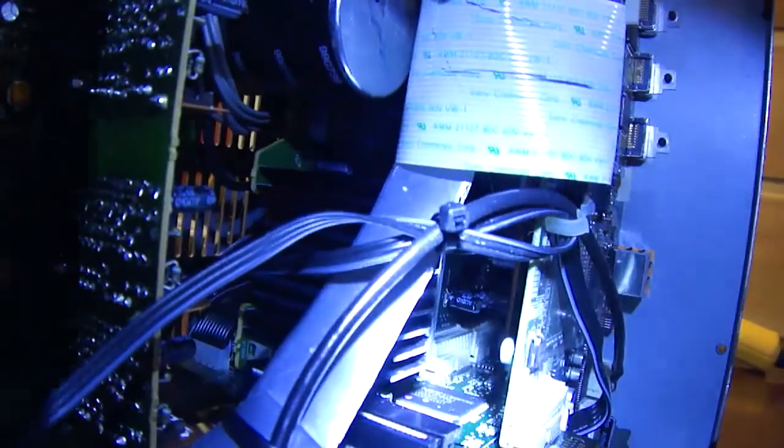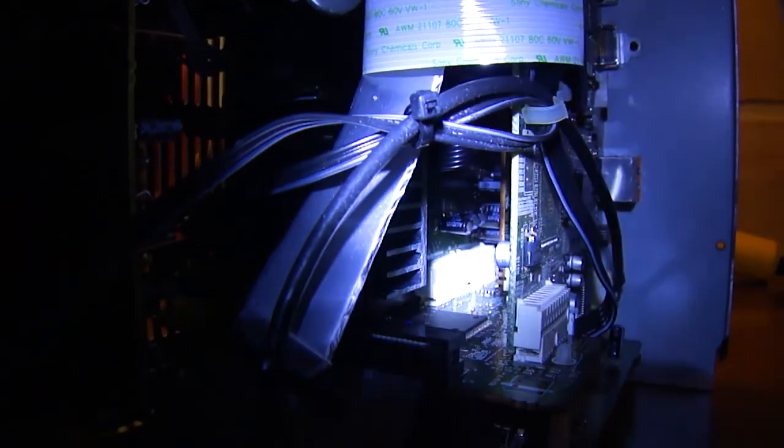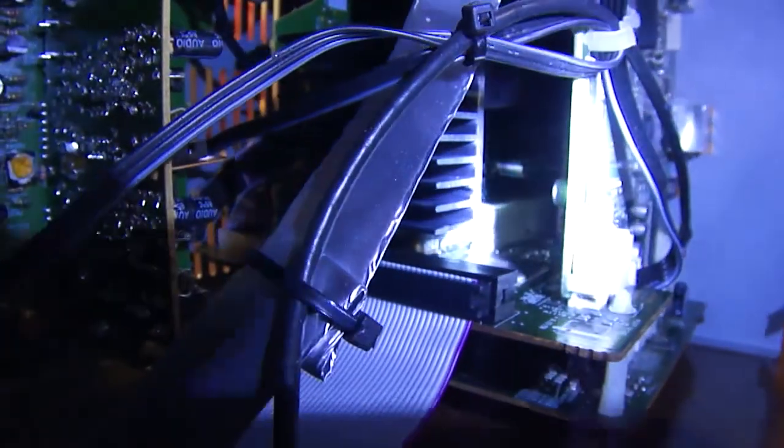Directly above that, I don't think I can get it in view here, there's an aluminum capacitor, and there's probably some more up underneath there that I can't see. That aluminum capacitor is sitting directly above the heat sink, so when this thing is sitting flat, all the hot air rises. So it's going to dry out any components that are in there. There could be other capacitors in there that I can't see that are hiding. I don't know. But anyways, we have sound.